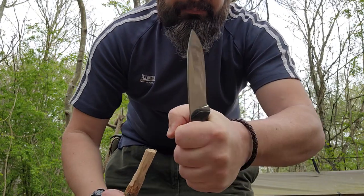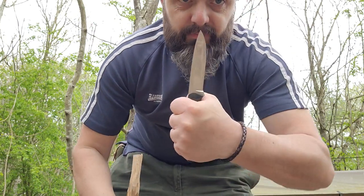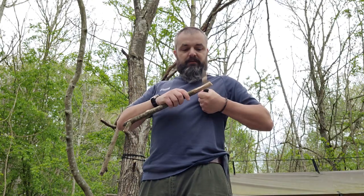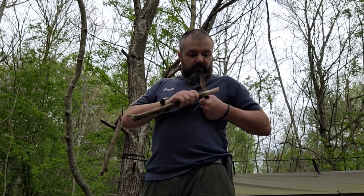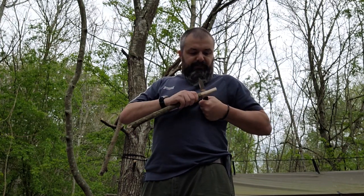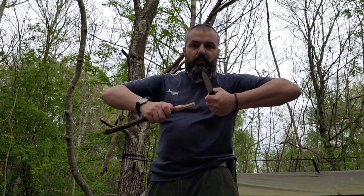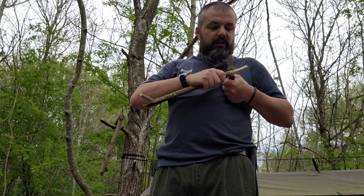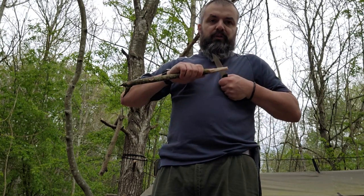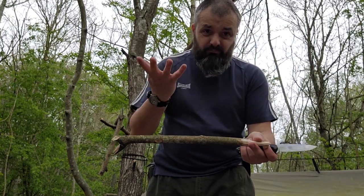With a lot of material to move, do the reverse grip - your thumb's not on top, it's tucked away like making a fist. Again all these cuts need practice, nobody's going to get it overnight. With this grip, you slap down chest like this and again you're moving the stick - this removes more material. If the knife flies out of your hand, you're not out here with it stabbing outward - it's nice and controlled, more your center of gravity, chest high, moving the stick with very minimal movement from the knife.